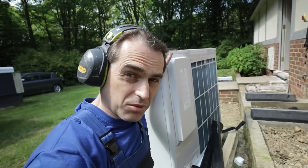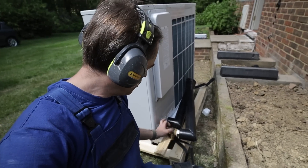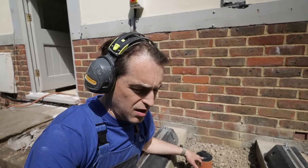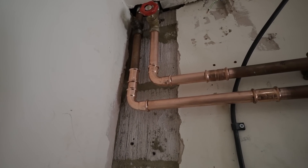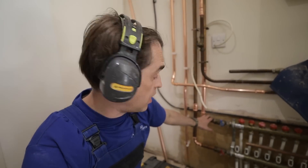We are now at the stage where we're ready to position the unit on its footings. We've got an anti-freeze valve connected to the return, and the soak away is done — a drain pipe going about 70 cm into the ground, surrounded by shingle, with shingle going on top of this area as well. The feet are fixed to the footings. My pipework for the cylinder is almost ready. I've reconnected the old flow and return pipes for radiators and underfloor heating, removed the radiator pump and the heating circulator, because we're going to rely on the circulator in the external unit alone.